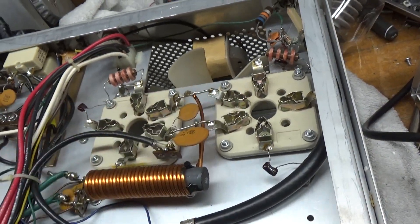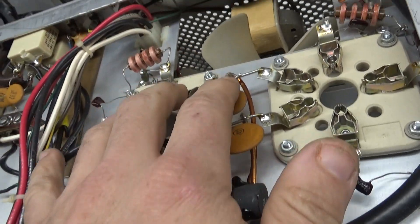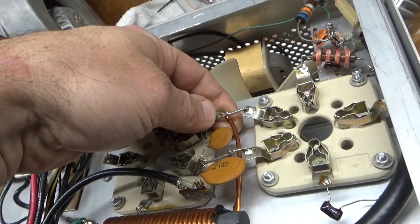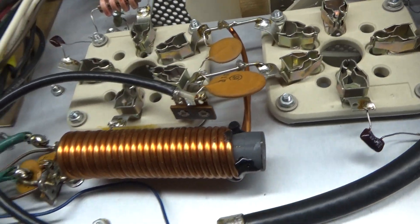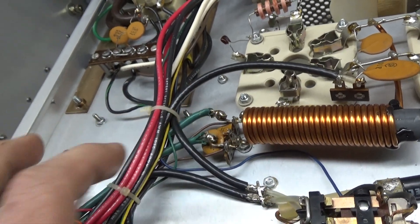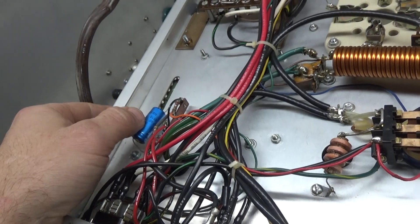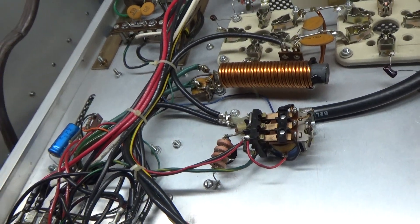Take the grid chokes out. It's a lot of bad solder work. Right here, I'll unsolder that and crimp it around and re-solder it. Bad solder work over here on the filament lead connections. Change the electrolytic cap. I'm just going to go through the entire thing — just a lot of little things, it's a lot of work.